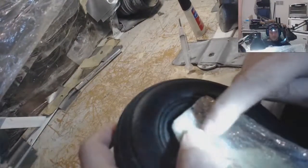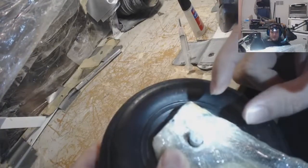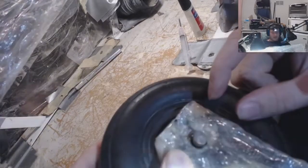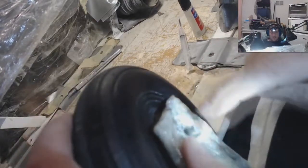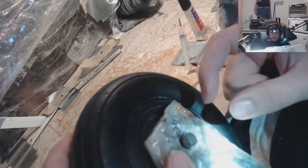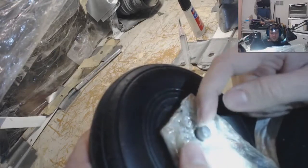So, I'm going to wrap fabric around this metal shaft. No, first I'm going to connect double stick tape to 1,000 denier nylon upholstery fabric. I'm going to connect 3M 300 LSE low surface energy adhesive transfer tape to 1,000 denier nylon fabric and wrap that around this shaft. And then I'm going to do the same, wrapping it around a washer. So I'll have a fabric-coated shaft and a fabric-coated washer. I can line up the washer and then sew the washer to the fabric of the shaft.